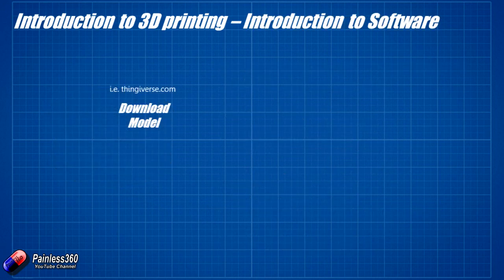Very quickly, let's talk about the steps to actually get your model that you've got on your computer screen into reality, sat on the bed of the printer at the end of a couple of hours. Now, the first and easiest way to do it is to download the model that you're interested in. Loads of places, like for example thingiverse.com, have fantastic models that people have put time and effort into creating already, and those are available to download, usually as an STL file. You download that STL file, which is just a set of geometry that describes the shape, and then you load that into some form of slicing software.